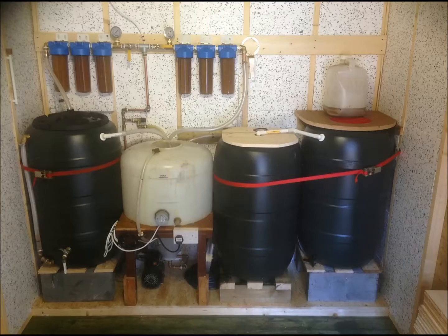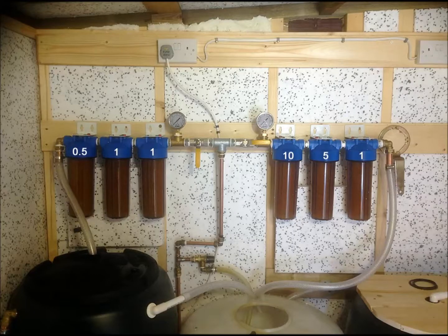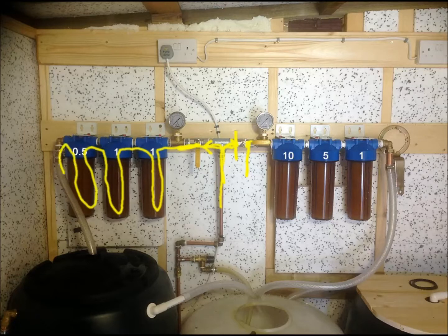We let it run for say half an hour or so until we're happy that it's gone through there as many times as it possibly can. Now we want to get the oil over to our storage barrel. So at that point we take this lever valve here and flip it the other way — we open up this flow so the oil can come along here and flow down that pipe, and in turn we close the other one off. So the oil comes up thanks to the pump, can't go that way, comes through here, goes through a 1 micron, goes through another 1 micron, and goes through a 0.5 — a half micron. I was very pleased to find a half micron.